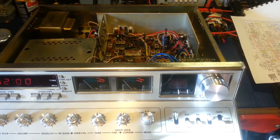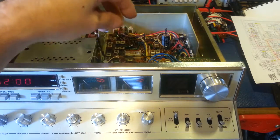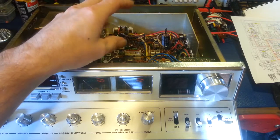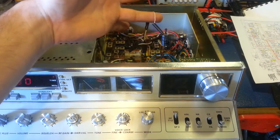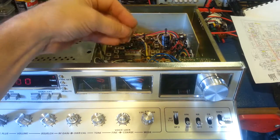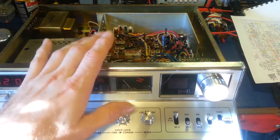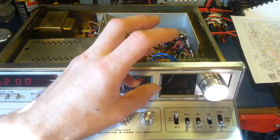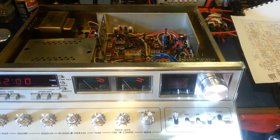A common way people try to fix the afterglow is by understanding what causes it. When the two light bulbs are in here, those two little light bulbs supply just enough load to the circuit to draw down that voltage. It's only two volts hovering with very minimal current, and the load of those two incandescent light bulbs is enough to drag that voltage down to basically nothing, so the channel indicator will no longer glow. But with LEDs — LEDs are so power-conserving — the instant you've replaced those two light bulbs, any time the radio is turned off your channels will dimly glow. You can actually change the channels and see the digits, very dim but visible.